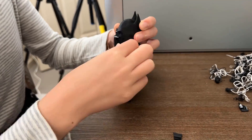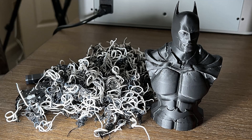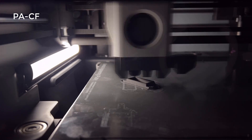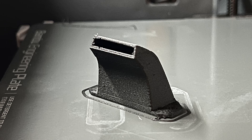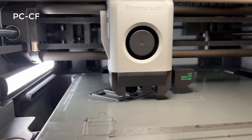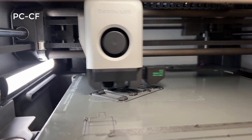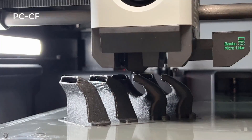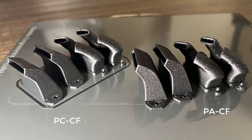Let's see if the support is easy to remove. It can peel off easily, but it also creates quite a lot of wasted filament. Next, I will try some carbon fiber filled filament, starting with this PACF nylon carbon fiber filament. I will print some fan ducts and functional parts, and the result is not bad — though you can't compare the surface quality of nylon carbon fiber with PLA. I then tried another polycarbonate carbon fiber. This PC mix seems to print better than the nylon mix, and when you compare the fan ducts printed, the PC mix looks so much better.